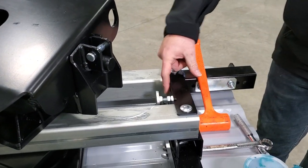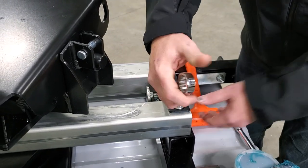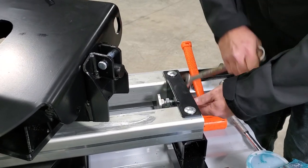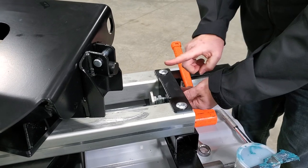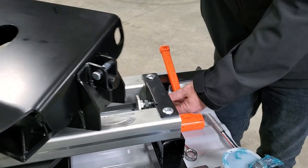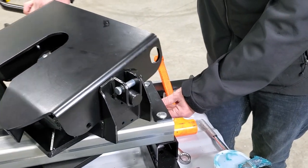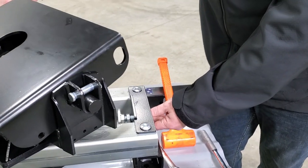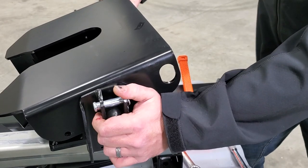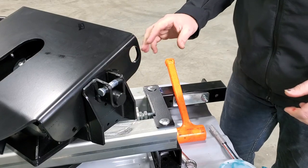If you look, there's a jam nut right there. We're going to use an open-end 15/16" wrench. Loosen up the jam nut a little bit, and because it's too loose we're going to screw the plate out that direction a little bit. I usually go about a half a turn at a time. Now we're starting to get a little resistance — I'm going to put a little bit more, and you can see I have to use both hands to get that to lock in there. That means that's how we want that adjustment.